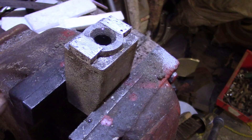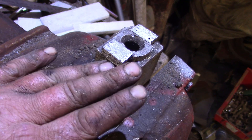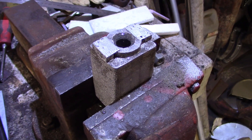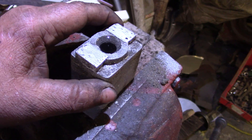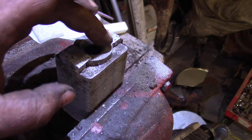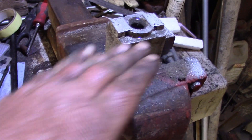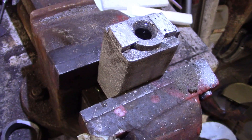I've learnt some important lessons with the making of the pattern, as far as how I cut it and work with it is concerned. The vibration absolutely works amazingly. I'd only ever done lost foam casting just by pouring loose sand in, and at best what I would have had would have been something with very little internal capacity, because the sand would have just sand-duned inside there like an hourglass almost - it would have had shoulders an inch thick. At worst it would have collapsed. This has worked very nicely - this is absolutely fantastic.